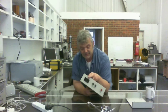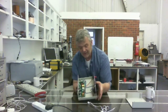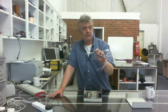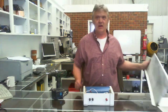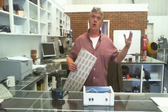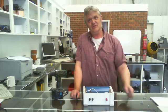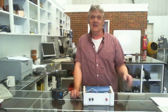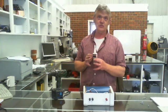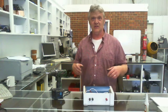This mains plug I bought from Maplin or Radio Shack — it's a fused mains plug, so there's a fuse in there and I can plug my kettle lead in. That's the whole unit finished. Now I need to make a housing unit for the lamp. What I used to make it was Builder's Board — a PVC-clad polyurethane foam you buy in a whole range of widths and lengths, usually about £25 for a 5-metre length. You can saw it really easily, it cuts with a carpet knife, sands beautifully — really excellent stuff to work with. You glue it with cyanoacrylic glue, and it glues so strongly that the glue bond is actually stronger than the material; if you try to separate it, you snap the material rather than the glue bond.